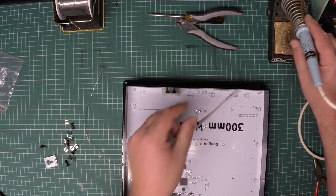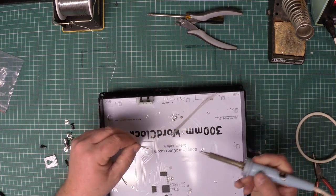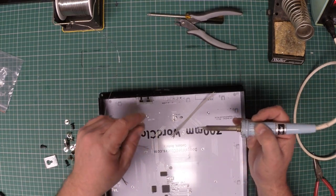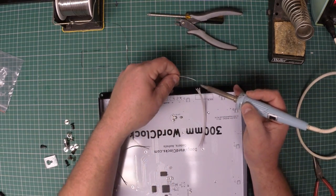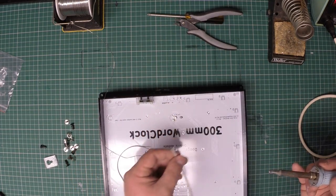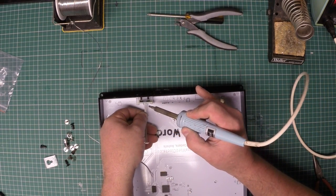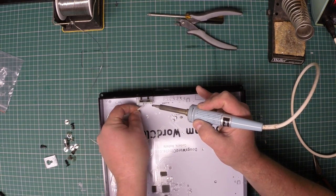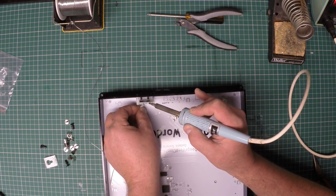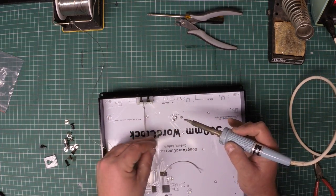So first things first, before we use any wire, we always tin it. And tinning is just the act of pre-soldering the connections so that we don't have bare wire sucking solder up once we install them. Now you'll notice that there are 3 little holes at the bottom of the button board. We'll use those to do the wiring. Again, the instruction manual is probably the best place to grab a close-up of that information. This video is certainly not for that.